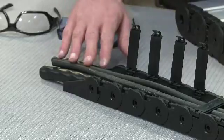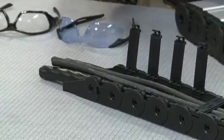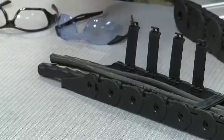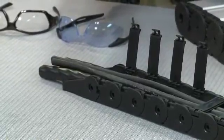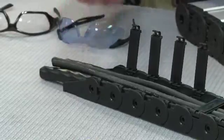The first issue is that this carrier system is overfilled. Electrical cables need to have a minimum of 10% free space when operating inside a cable carrier, and hoses need a minimum of 20% free space. When you add up the outside diameter of all the cables and hoses, we really don't want the carrier to be more than 60% filled. This one is way overfilled, and that's not uncommon from what we see out in the field.